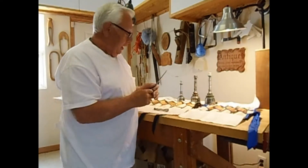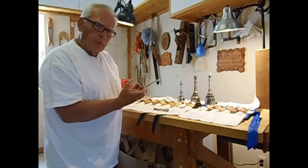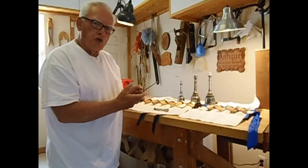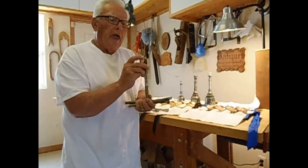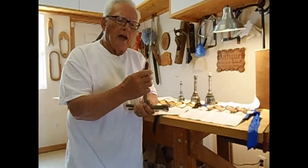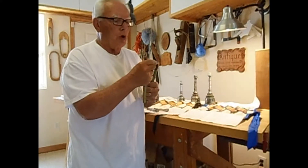One thing about Shaft tools is the steel quality — it's not real brittle but it has a lot of toughness that holds the edge very well. A normal stone carving chisel has an angle of 90 degrees, 45 on the side. This is the point. This is a chisel that I broke.